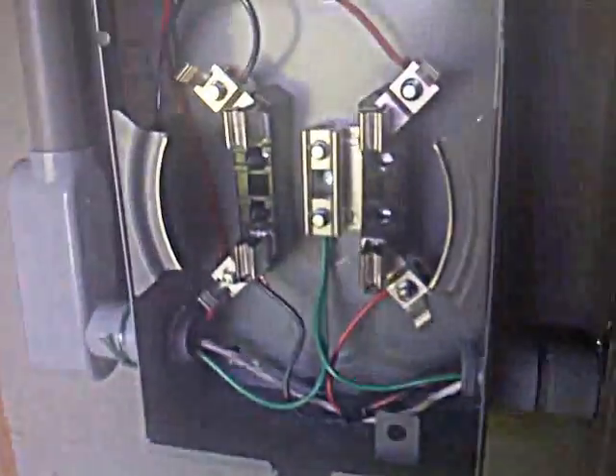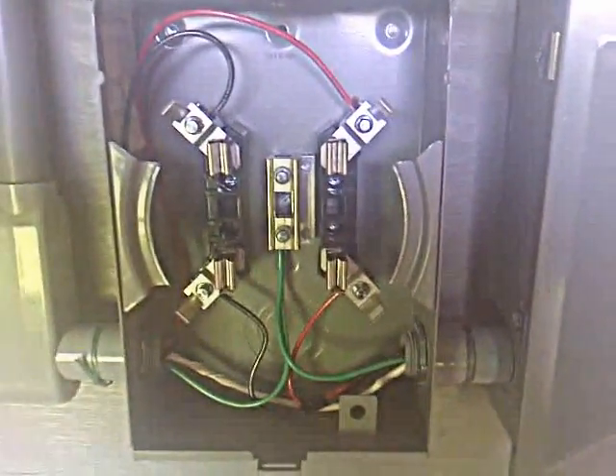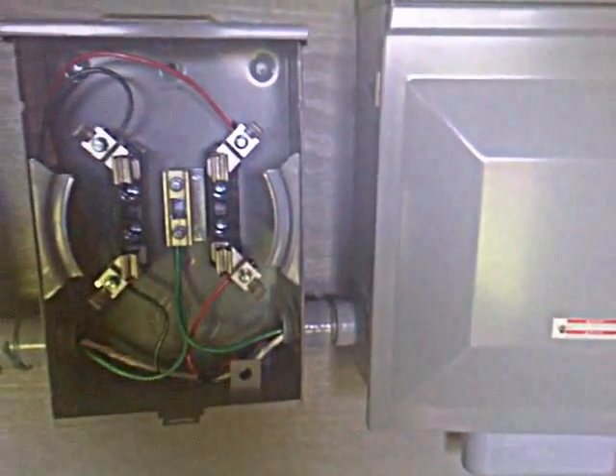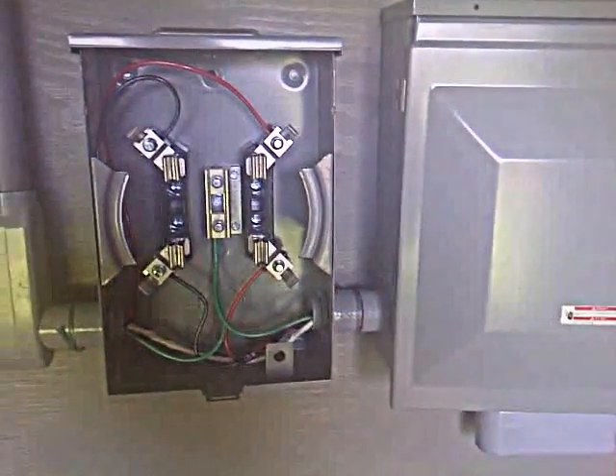If you're using the Chinese inverters, it's the same hookup here. It's a two-pole 20-amp breaker. You can go to a kilowatt meter, and then if you want to come out of the kilowatt meter and put another disconnect breaker, that's fine. Come out of those breakers, put a receptacle on each breaker — that'll give you a 220 system. Then you can feed two inverters or four inverters, split them up evenly on each receptacle. So one receptacle might have two inverters, the other receptacle might have two inverters. You pump all that through these guys here and it'll make the meter spin forward, and you can see how much you're registering. Even if you don't have that much electrical knowledge, if you just slow this tape down a little bit, it'll explain it to you. For about $60–$70 with shipping, with the can and the meter head here, you can have something like that — which looks a lot nicer. It's not a hokey-pokey thing where all these wires are hanging off the wall. A more professional way to do it — and this is all getting inspected.